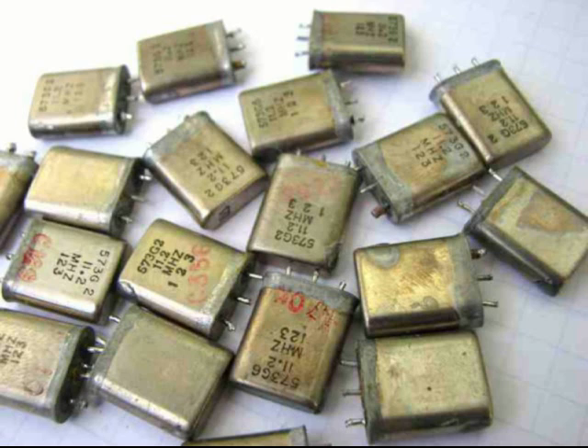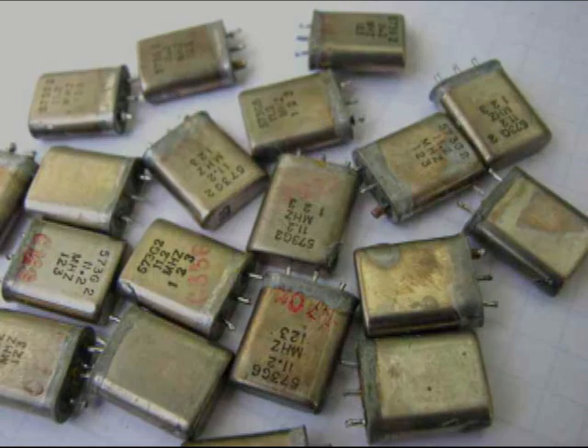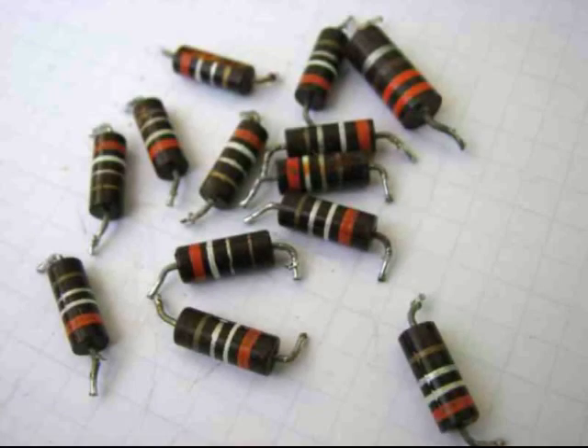Somewhere around early February of 2009, I was fortunate enough to be out at a surplus electronics shop in Portland and came across some remnants of the interior pieces of some GE — I think these were Master Exec VHF and maybe a few UHF radio pieces. The beauty was that quite a number of boards had these 11.2 MHz crystal filters — not really filters, just dual crystals — but I can do some unloaded Q measurements to find out how good these might be for making sideband or CW filters for single conversion.